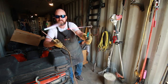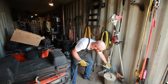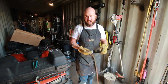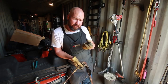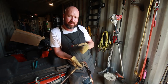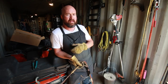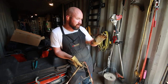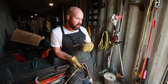We've got that glow going on. We'll leave that in the vermiculite probably for a couple of hours and come back and check on it — hopefully that gives it a good anneal. Before with just the propane, it was annealed enough that it was cutting with a file, but files cut sometimes a lot better than your hacksaw blade. I'm a little worried that just because we could file it didn't necessarily mean we could profile it with our hacksaw and start cutting our shape out. So I think we should be good — I'm going to set it out in the sun and let it warm that way, then check on it in about three hours and start profiling.